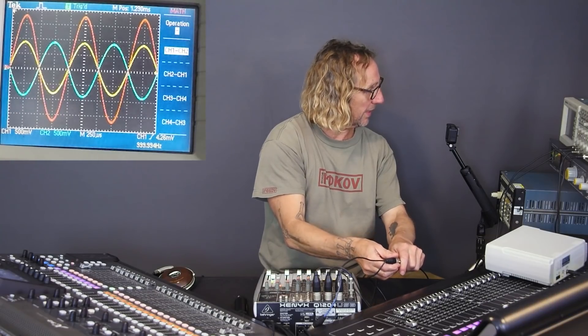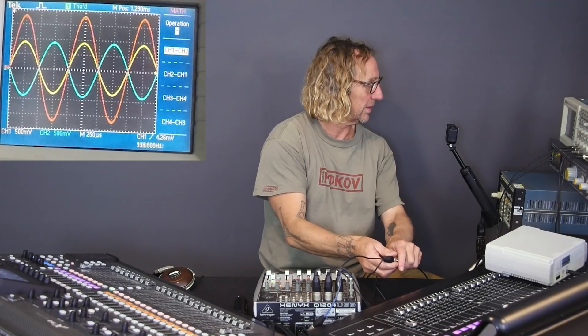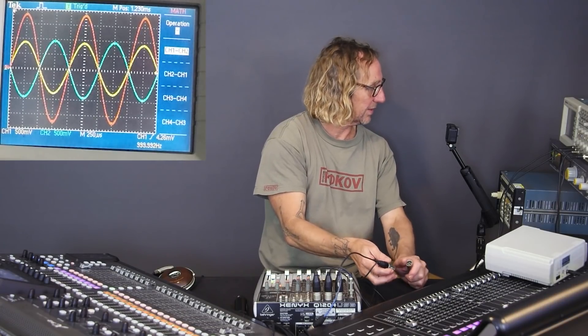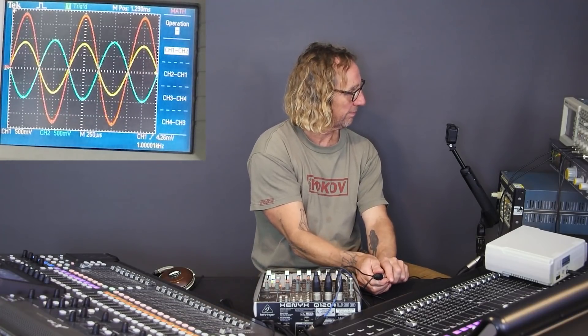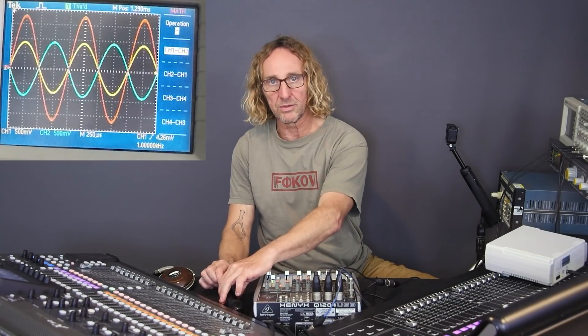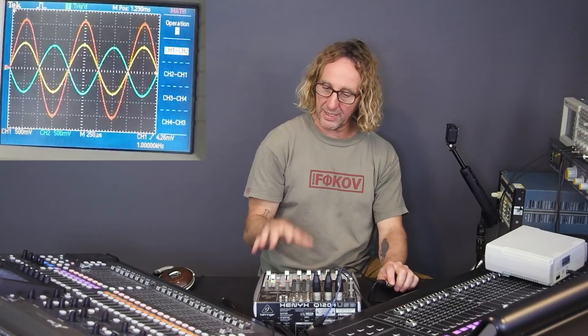With one load on the M32, it drags down just a little tiny bit — about a tenth of a volt. Let's see what happens on the X32 — it's a similar small drop. This shows that measuring outputs with test equipment and not putting an actual load on it tells us more about what's going on. Now on the Behringer, we actually see a bigger drop. It has more output but it also drops more when loaded — suggesting a slightly higher impedance output.